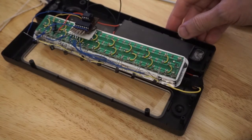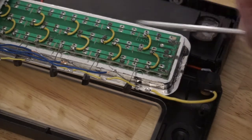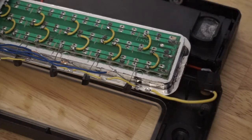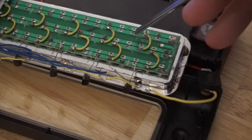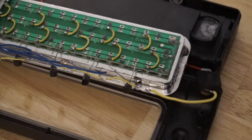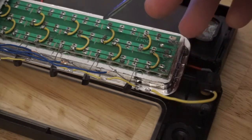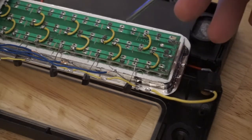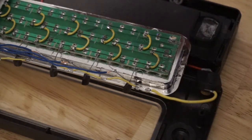Internals of the modified worklight. Originally, the 72 LEDs were arranged in 3 rows, each a row of 24 LEDs. Was powered by these parallel strips, copper strips. But as you can see, I've cut through the negative strips about every 3 columns. Soldered these bridging wires. This wasn't part of the original worklight, so these had to be soldered on to connect a 3x3 block of LEDs together. And you have 8 of these blocks all along the entire length of the worklight.